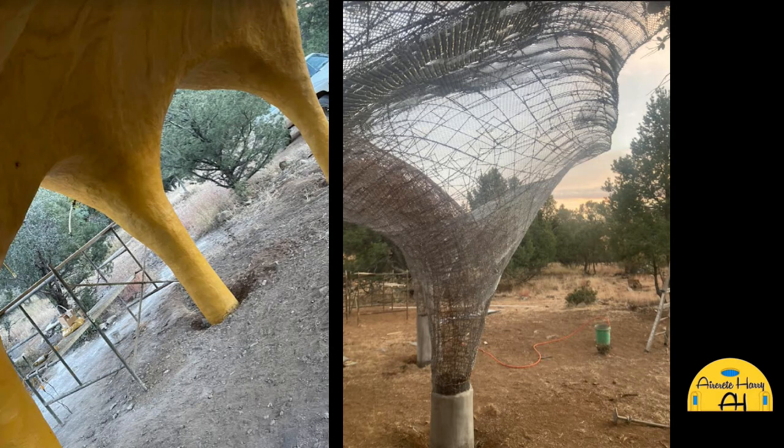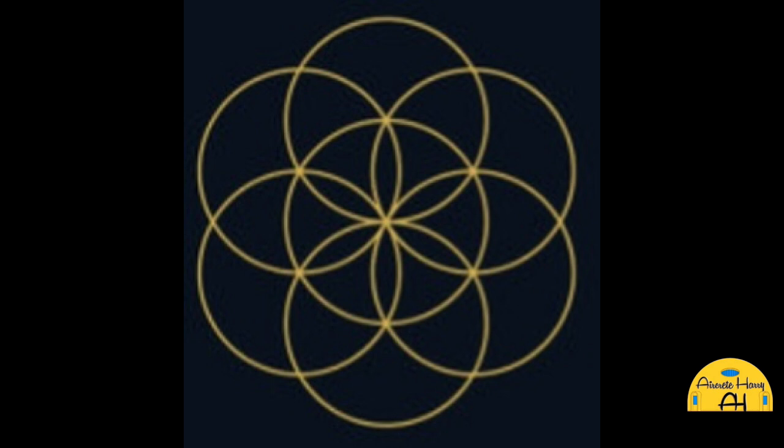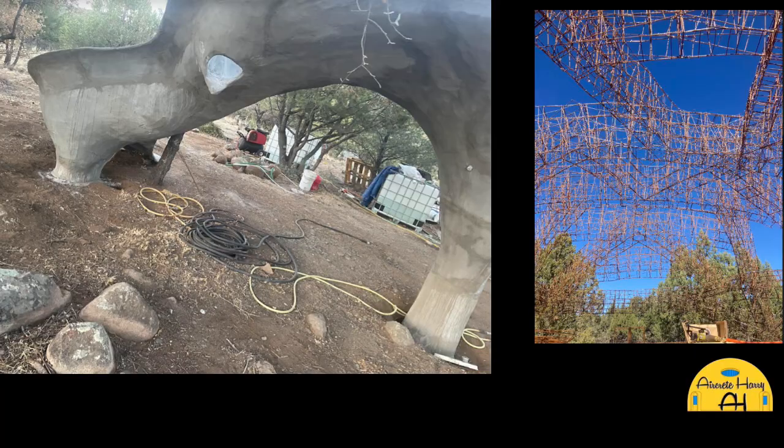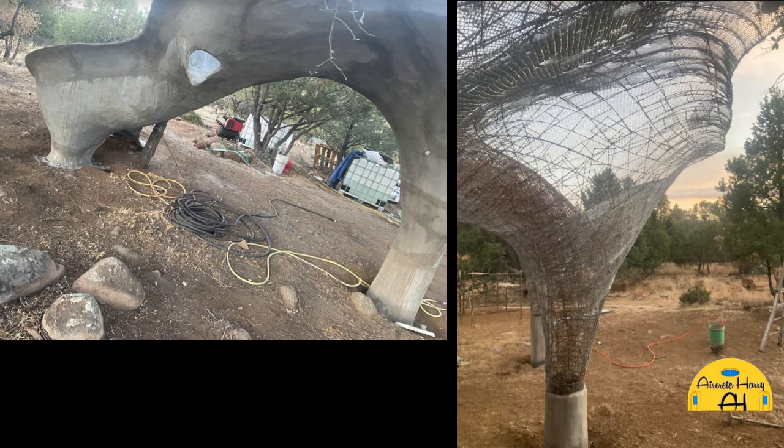Those are the funnel columns within a pavilion, and they follow a very specific geometry. It's a straight column that comes up 2 feet above your finished floor height. I mean, the finished floor height on those two columns, I think, is about 15 inches up on the column. But then it starts this curve, and the curve is relatively consistent in all directions, about a 15.5 foot radius curve that starts from that 2 feet high cylinder. And that 15.5 foot radius goes up to about 5.5 feet.